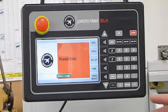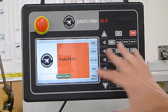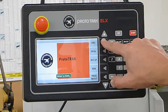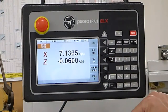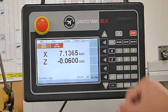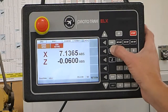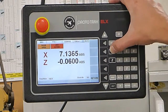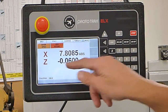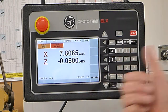In order to manually move the machine from the digital readout, make sure you go into mode so you can see this screen. You can go into DRO for digital readout. In here you can choose to jog a certain axis. The X axis is going to be the diameter. The Z axis is the direction going towards the chuck or away from the chuck — so it's the length of the part.